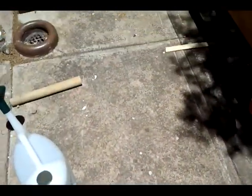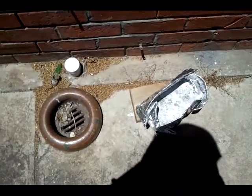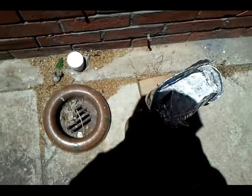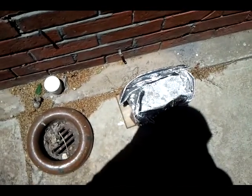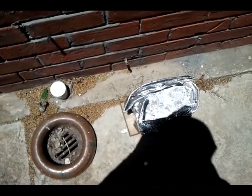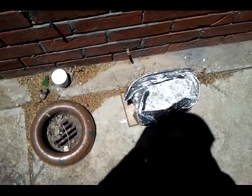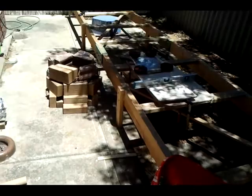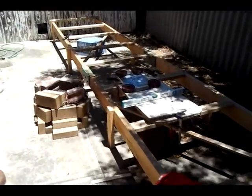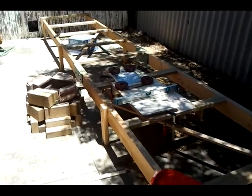There are some scraps of lead drips coming back this way but I don't think I wasted too much. In here it's still slightly liquid — that's the surplus. I've got an ingot now cooling in a little aluminium tray which I will try to extricate later. So there's probably a day's work — it's an awful lot of days' work in building a boat — but there's one of them: the lead ballast for the centre board.